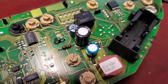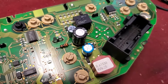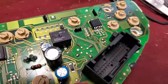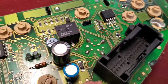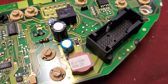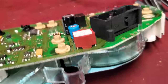We have three electrolytics here. It would be a hope and a dream that this would fix it, and I think it very well could be — one of those is bad. You can see it's a switching mode supply here, a little buck boost with the transformer, and this right here would be the chip. Here's our coil — this red thing. We'll have to check these with the ESR meter. The question is how to get to them — this is not very serviceable.